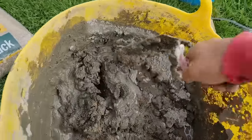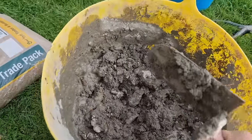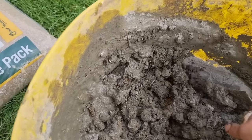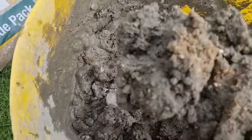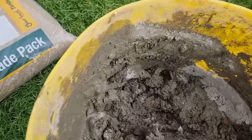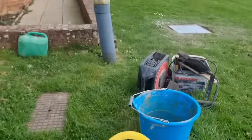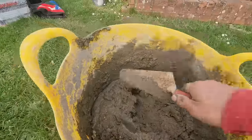That's all the manhole covers on the job dropped. Now I just need to get some muck together — I'm using sharp sand and cement — go around and give them all a nice little point up over the top to make sure they're all secure, and then we'll be done. I always use sharp sand when going around stuff on the ground because it's got stone in it, more durability, less likely to crack. I'll put half a bag of sharp sand and about a quarter of a bag of cement. I won't knock up too much at a time since I've got to carry it around everywhere.